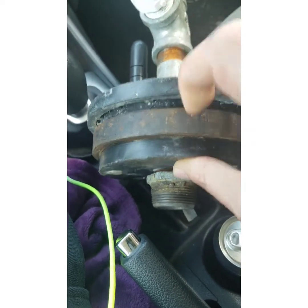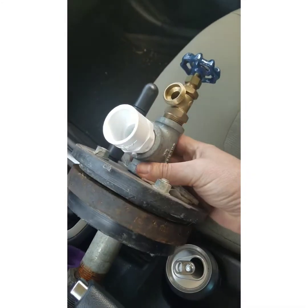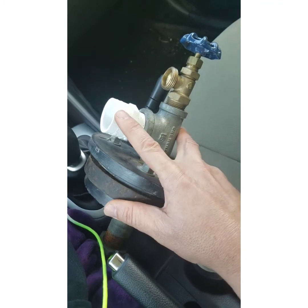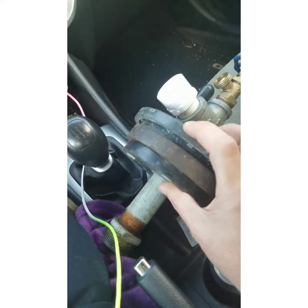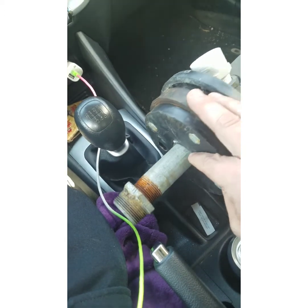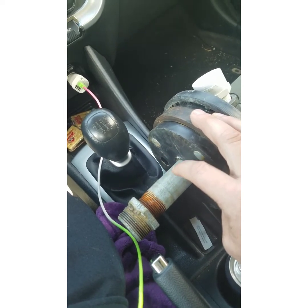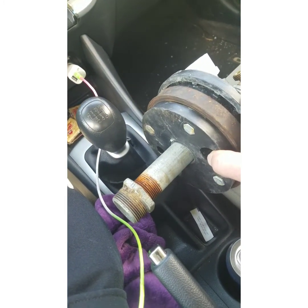On the very bottom you've got a T, and everything will be set here on top of the well. You've got your T, your hose bibb, and your plastic one-inch male fitting that goes inside your T — this is what comes out going to your house, feeding water toward your pressure tank. The T will be screwed onto your pipe underneath the well seal. You'll have 20-foot sections of pipe — 21 feet if it's galvanized — going down to the pump. So if you've got 200 feet of pipe, you'd have 10 pieces of pipe, and then your pump.